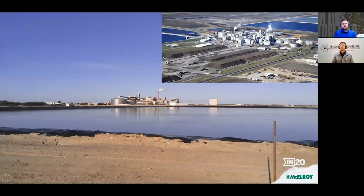It was during those 14-inch tie-ins that Dave briefed us on the 8-inch valve chamber tie-ins for this project. Before I get into the scope of work for that, I should describe how our piping system for this pond works. Throughout the sugar refining process, the produced water has some organic material left in it and is placed in this pond, where that organic material settles to the bottom and begins to decay and turns into a sludge. The 8-inch system that we were here to help tie in was designed to recirculate that sludge, as well as inject air into this water to help accelerate the bacterial growth and break down the organic solids. They process this water and treat it and clean it, put it back into the ecosystem, and then the cycle of refining sugar just keeps going.